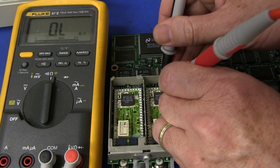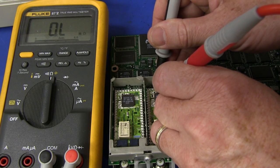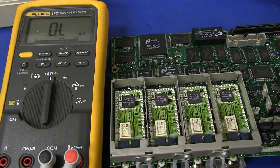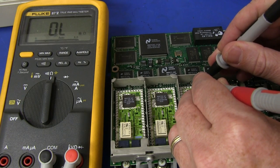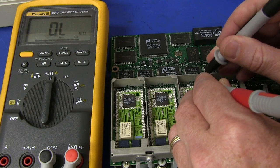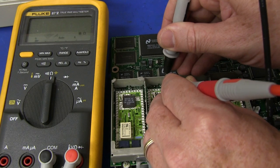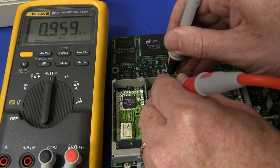Drat! I was hoping it would be that easy — I'd be able to find something. But no, that's fine on that pair. Now I can actually test the other pair. Putting the pins across there — 0.785 meg. Okay, swap them. Not measuring anything low impedance there — 0.787. The actual values don't matter because you can just probe around. Ah, there you go — that's slightly different.